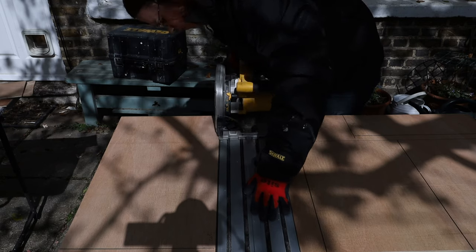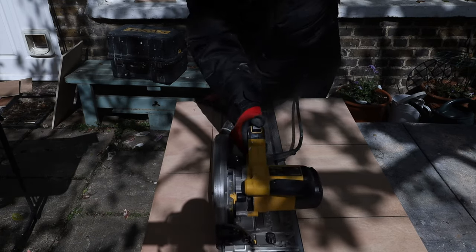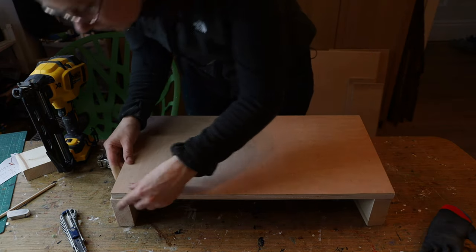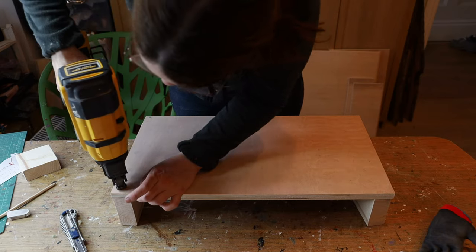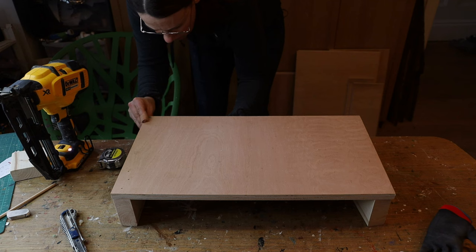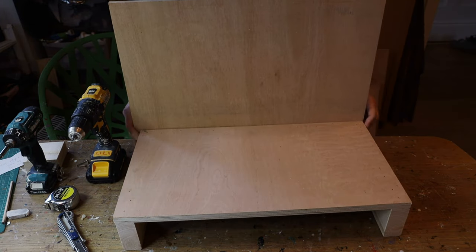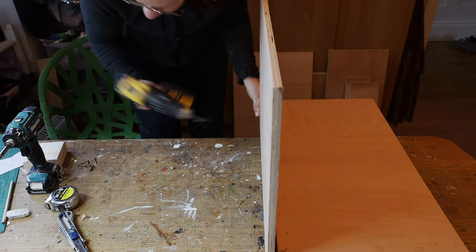I've cut some pieces of plywood to create the base of my platform and also for the walls, and some pieces of studs for underneath the platform. I use 18mm thick plywood, but 12mm will work as well. I place them on top of studs, line them up on the edges and use a nail gun to attach them together. All my platforms are raised because it's for stop motion animation — I need space underneath to access the screws for the puppets. Then I use other pieces of plywood to create the walls, drilling into the studs and attaching the walls to them.